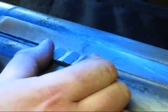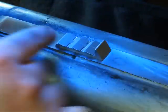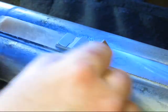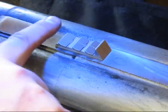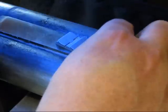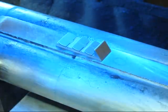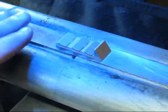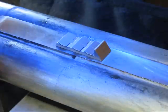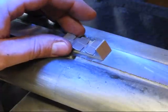...I won't be able to actually push it into a standard dovetail because I'll be below the top line of the barrels, and there won't be any way to drift it in and get it in position. So what I'm going to have to do is machine this wide - longer than the sight base is - then dovetail one end of it, and put a clamping piece in the other end so that the sight can be dropped down in. Then a little piece can be put on, drilled and tapped, and you'll be able to tighten the screw down to lock the sight in position. I knew this was going to happen when I first designed this on paper.